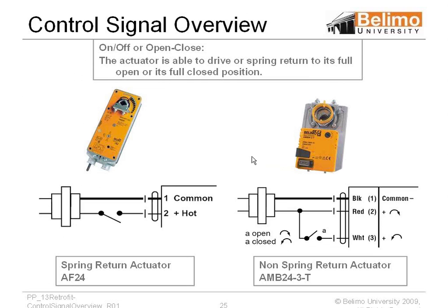That's a very odd wiring diagram, but what it allows you to do is — typically if you're going to do two-position, you'd use the motor on the left, the AF24. But if for some reason you have a pricing issue where you do not need spring return but you have a thermostat that's not a three-point or floating thermostat, here you can use something like a T87 — just two wires — and operate it driving open and driving close. What's odd about this is that you can put power directly on two and three and the motor will drive in the opposite direction. Normally on a three-position motor, if the motor's running the wrong way, you switch two of the wires. With Belimo, there's just a little directional switch and it'll run the opposite direction.